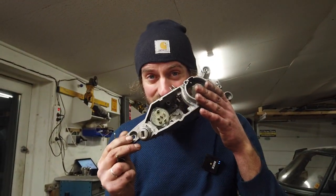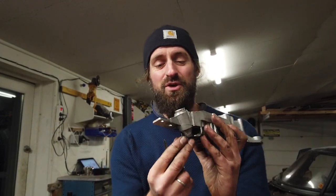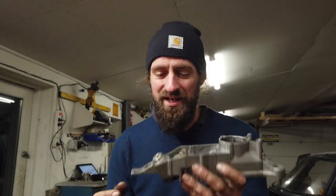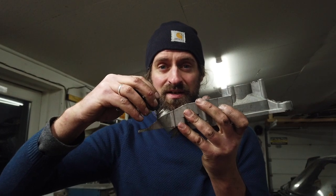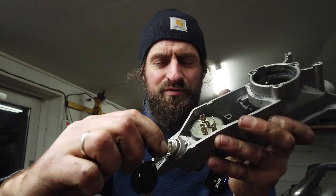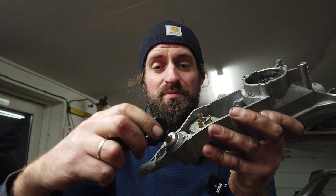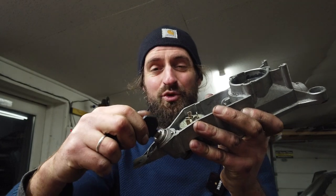It's rather late at night now, but everything is back together. I had to fiddle with a lot of stuff because it seems as though a lot of the joints and the barrel and all that have some play in it. And I have greased everything up and now I can put the key in. Turn it to first position. Now I cannot take it out. That's also good. Before I could take it out in all positions, so that's also an improvement.